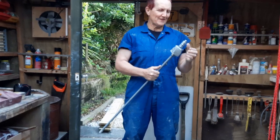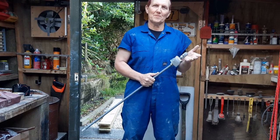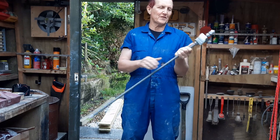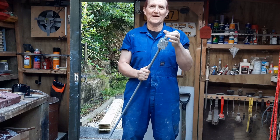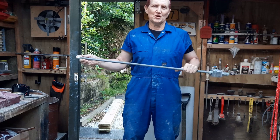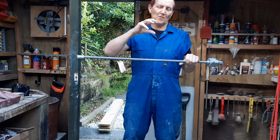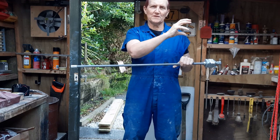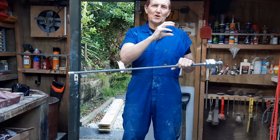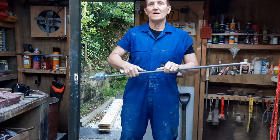So for today's episode and session, I'm not actually going to be doing any digging in the bunker shaft. Instead, I've bought myself some of this threaded rod, a couple of lengths of that, some decent sized washers and nuts. What I plan to do is drill some holes into the side of the shaft through the clay, 100 mil using the auger, and then I'm going to concrete in basically some rebar.